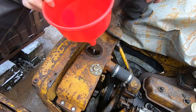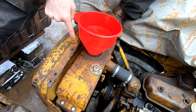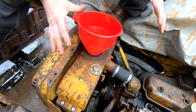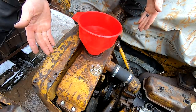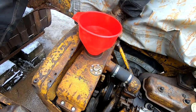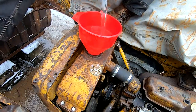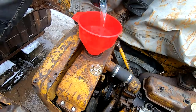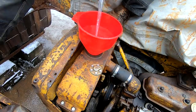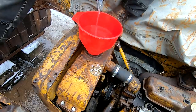So a while back I put three gallons of straight coolant in the engine to offset the water in the block so it wasn't completely water and didn't have any damage to the diesel. Come to find out ethylene glycol at 100% freezes at 8 degrees Fahrenheit or negative 13 Celsius. So 100% coolant or antifreeze actually has a higher freezing temperature.